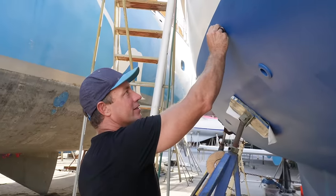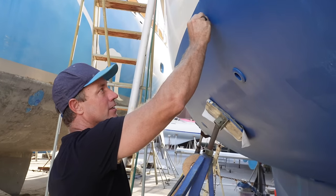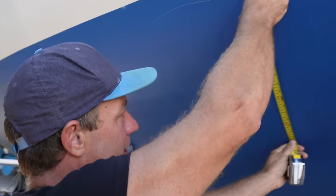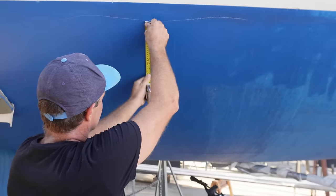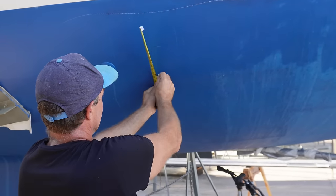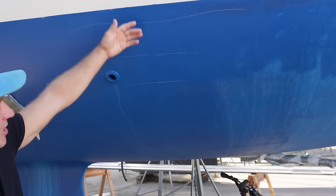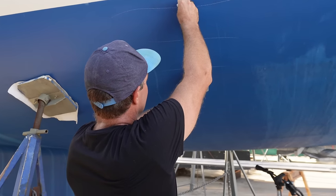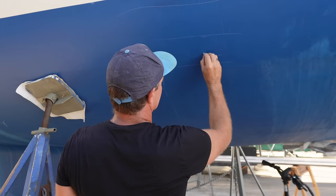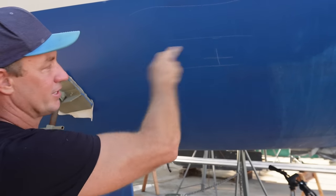So we've roughly got — I've actually extended this up a little bit — our waterline is probably around here somewhere. Lumatec suggests around six inches, which is here, and twelve, which is down here. So they recommend being in that part of the zone somewhere. For us, we're going to go about eleven. And we've got four of those to go on.